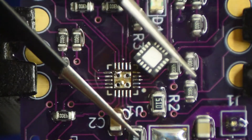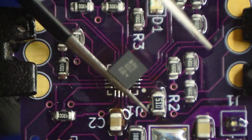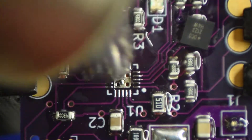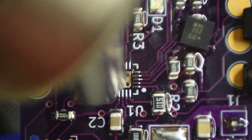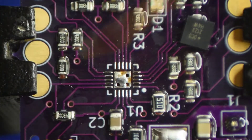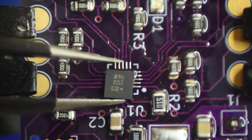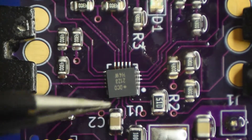I want to double check the mounting orientation of the chip. The solder on the thermal pad is not smooth, so going to do more than just a preheat — going to go ahead and reflow the solder. Of course, after that we'll have to apply some flux. Then placing the IC, trying to get it as close to square as I can.